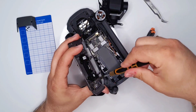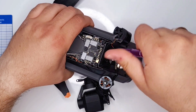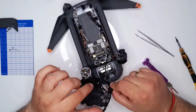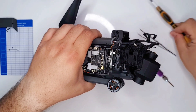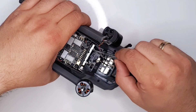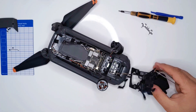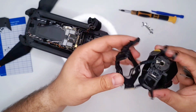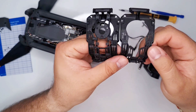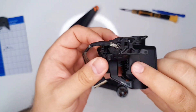If you pull it there is a big chance it might tear or snap. Here I'm removing the gimbal suspension bracket which is held by a few screws, and after this we need to remove the metal bracket holding the cables plugged in, and then remove the cables themselves. This camera was not transmitting image - there's a break in the cable somewhere along the way. There is an external one as well which we can see clearly later on in the video, and I think the actual connector is broken on the side that plugs into the drone. There was no video transmission, no signal, no nothing - the gimbal was completely dead.